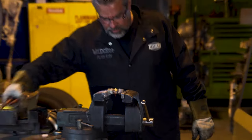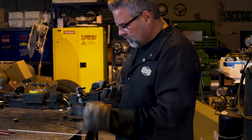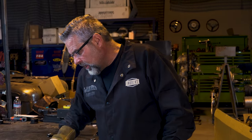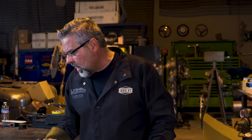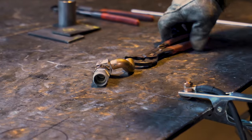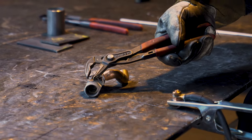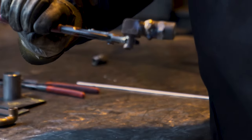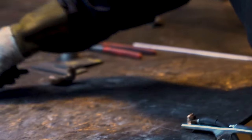The best thing to do when welding brass like this — a lot of times you're not going to be able to just go out and practice. So if you have a chance to practice welding a little bit of brass and copper to brass, you can interact these metals. You can actually weld copper onto brass. There's a repair job for a piece of brass — you could screw this into whatever you're working on and plug this piece into your hose. It's not beautiful, and it's really hard to get brass to look really good, but there you go. So now we've got stainless and brass welded together, and we're going to try a little copper next.